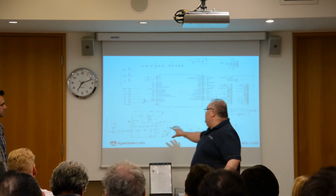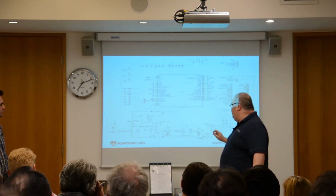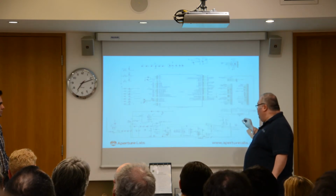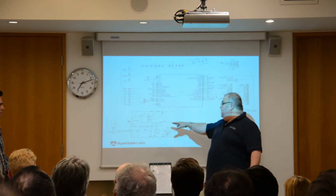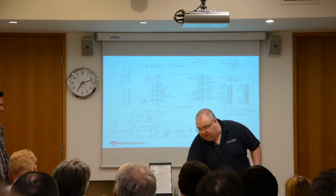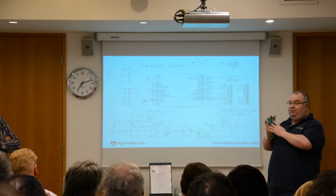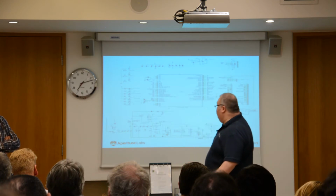So this is what our very front-end circuit is doing. It's detecting that small voltage drop. We then have some comparators for threshold detection, and then we simply take it through a Schmitt trigger and an OR gate. We also use a digital pot to set the thresholds on these comparators. And the main reason for that is we want it to be software controlled. You've noticed this has a couple of small trimmer pots on it. That's for when you are deploying it as an actual device. You don't have your CPU. You're not using the digital pot, so you can actually set it to something sensible to read the types of cards you want to use.